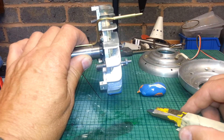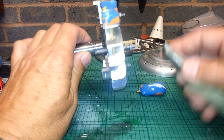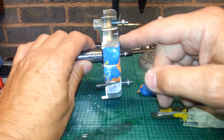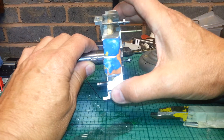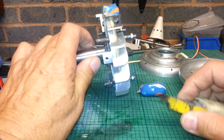What you've got to do is run this in reverse. So when you've got all these voids filled with plasticine, you can then true this front face up and these outer edges to — I think it's 107.4mm diameter.